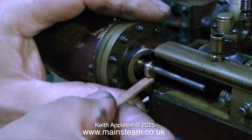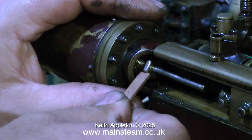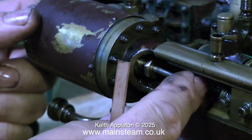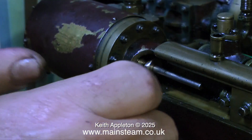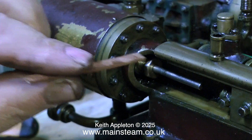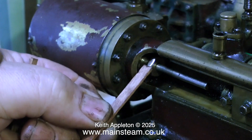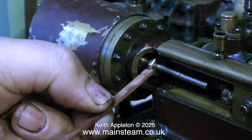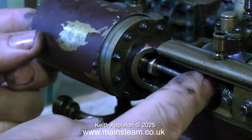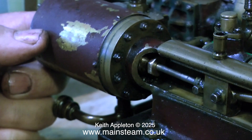A quick tip, as you can see here, on tightening gland nuts. I do not know why people put hexagon nuts for gland nuts in small inaccessible places, when it's much easier to have a plain gland nut with holes drilled around the outside so you can put a tommy bar in to turn the gland. Anyway, this one has got hexagon nuts. People normally use a screwdriver to sort of chisel the thing into place. I use a piece of mahogany that does more or less the same job — because I'm not trying to tighten it up too tightly anyway — but it does it without marking the brass. I might make a very fine spanner to tighten these gland nuts; it will be easier.